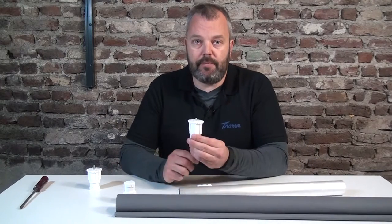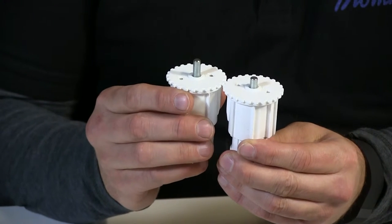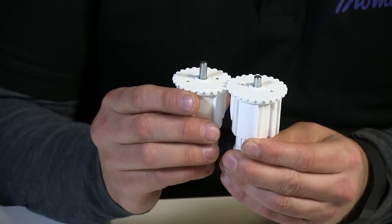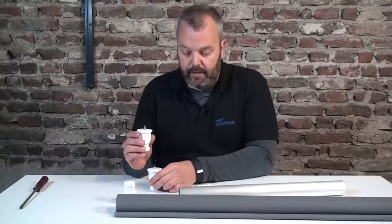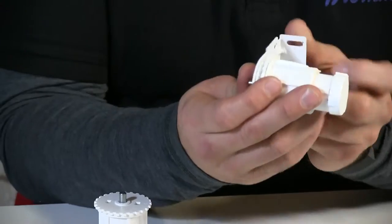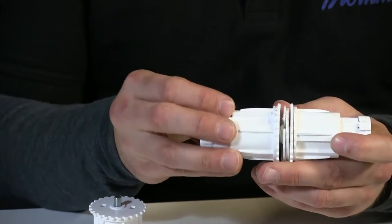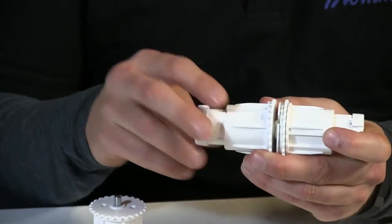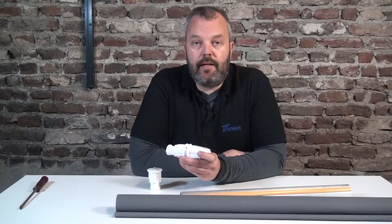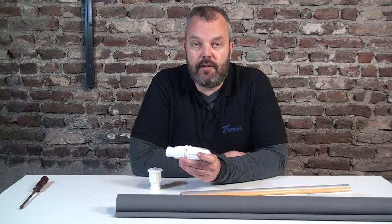Standard we use this M-plug with this little pin coming out, and we replace this with a longer pin if you want to extend the blinds. There will be a bracket in the middle which is basically a supporting bracket. As you can see it doesn't really connect the other end, it just keeps it in place and supports it. The result of that is that you do need two motors if you're going to extend your blinds, because you need one on the left hand side and one on the right hand side.